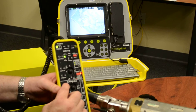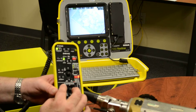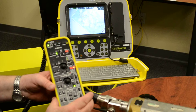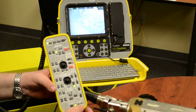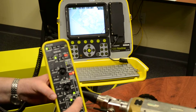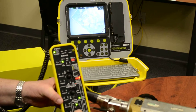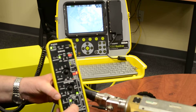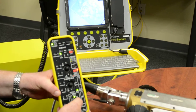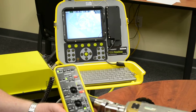So that's your zoom function, your rotating and pan. You also have focus - this does auto focus but you can override it and focus it yourself if you choose. You've got your lights and iris. For the iris selection, make sure it's in auto. You can override the auto with these two controls to close or open the iris. But if you leave it in auto, it will auto adjust to the lighting that you're using.